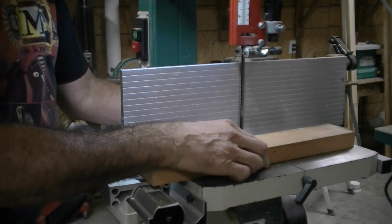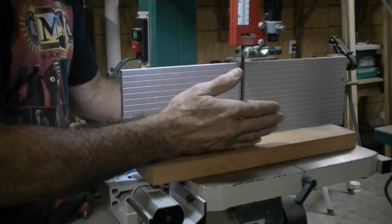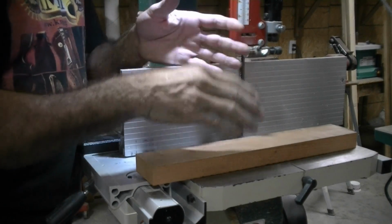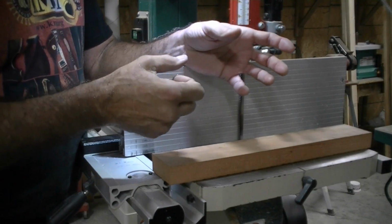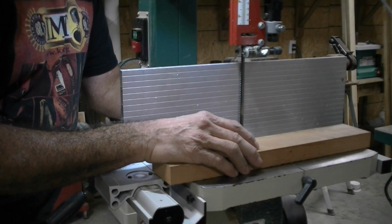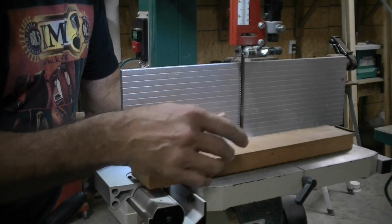If you want to know why I think that's a good method, the reason is two things. Well, actually three things. First of all, it stabilizes the neck. That's why they put plywood on the corners of buildings. It's very stable and it keeps the building from racking, twisting, moving, that type of thing. So by making this in multiple plies, you're giving that neck that kind of stability. Obviously, the second part is that it makes it a very strong neck. But then the third part is that it also makes it decorative. And I've been doing it that way since the beginning, so therefore I'm going to continue doing it that way. It's just a trademark, if you will, of the mandolins that I build.